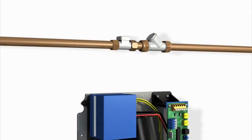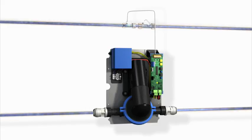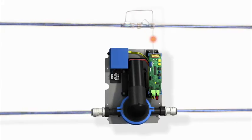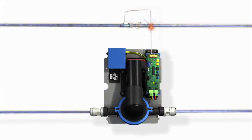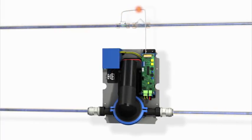The fourth innovation is a variable flow sensor fitted on the shower feed pipe supplying the shower. The flow sensor sends signal pulses to the PCB board to activate the pump-starting timer. The timer delays the start of the pump until the shower trap has a head of water, preventing air from being drawn through the trap, thus preventing noise.